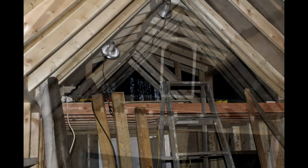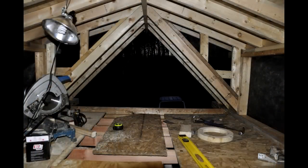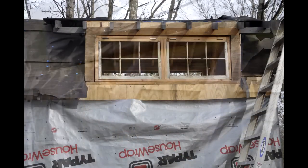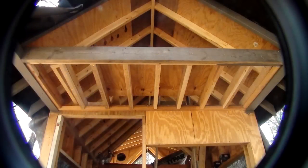There are some interior shots — for those of you who'd like to see them you can pause and look more closely. It's up in the loft area; it was kind of fun working up in there. You can see the top plate filling in between the rafters, a little wall up in the loft, and that's how I filled in between the rafters where the rafter tails stuck out. And then that's the framing for the loft above the porch.